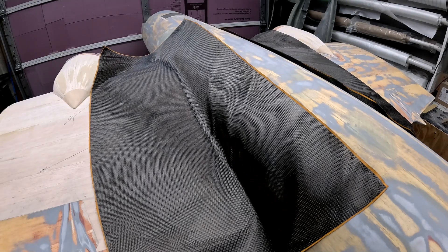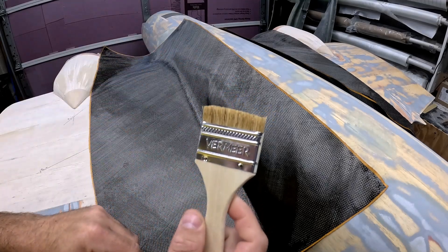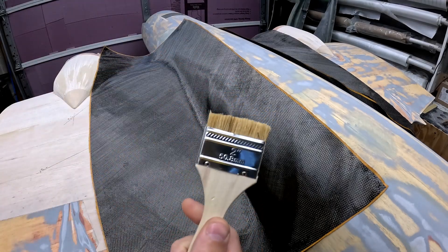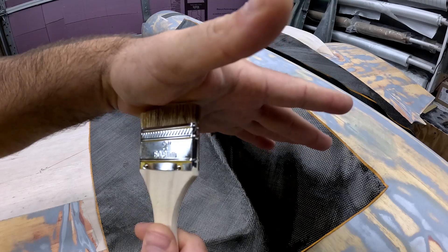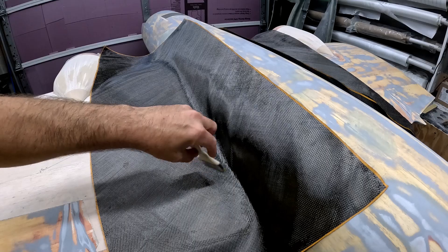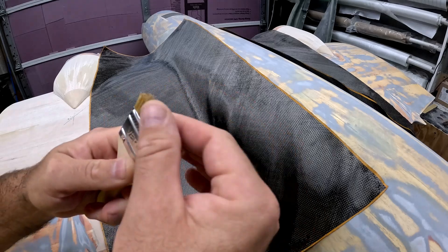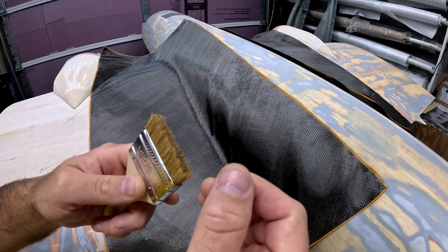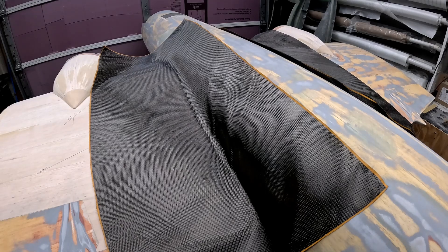Another thing I like to do is take little two-inch chip brushes and cut the bristles down so there's only about a half inch of bristles left. This keeps it from soaking up a lot of excess epoxy and gives you a stiff bristle so if you need to pat something down into a corner you have a nice stiff edge instead of really floppy bristles. It also helps get rid of a lot of loose bristles inside the brush. That's pretty much it — now it's just a matter of getting to work.